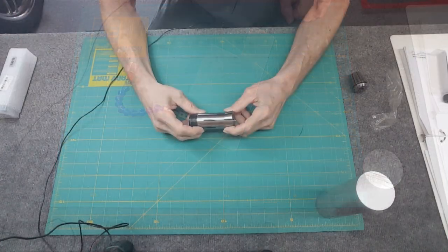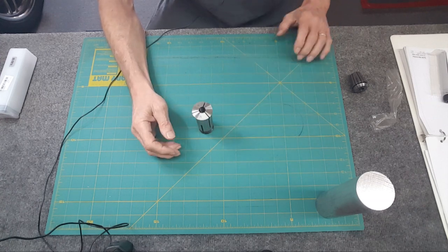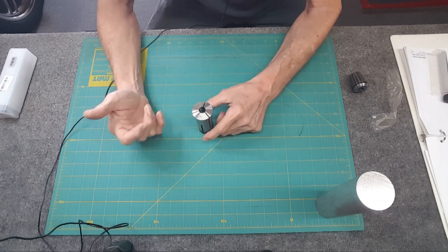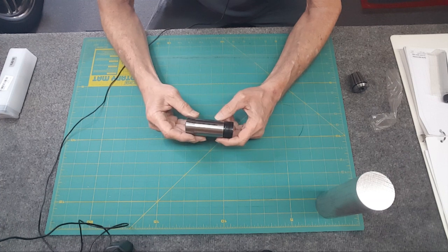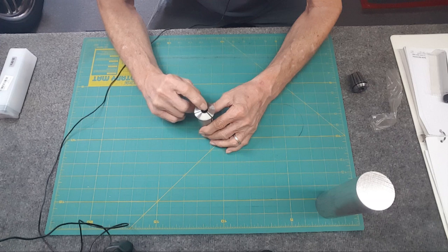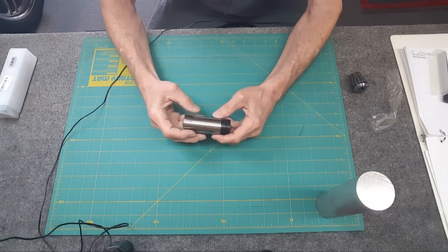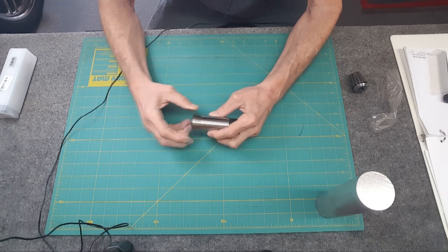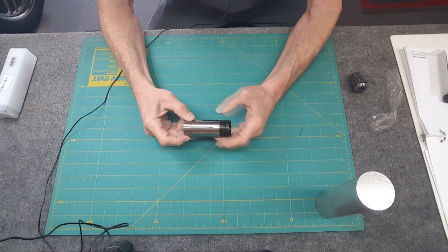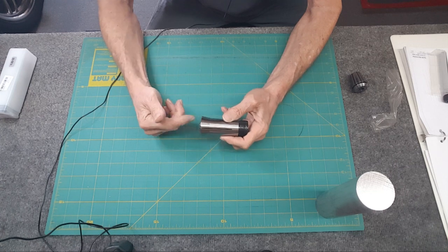I'll tell you the trouble you can get into when your biorhythm is way down. So let me start with this. On the tool grinder that I did the video on, if you're trying to hold stock that's the exact same size as your 5C collet, it works perfectly because it clamps here. This is stationary, note. So it's snug back here, and this is clamping on it.